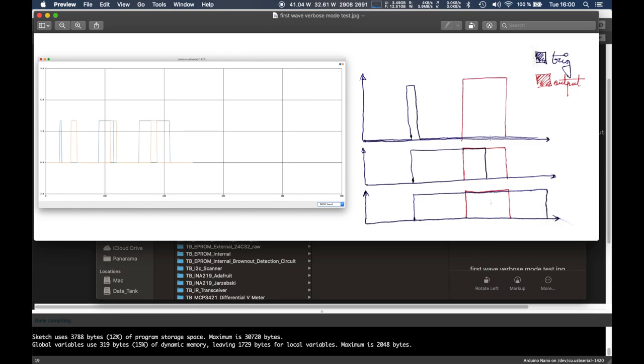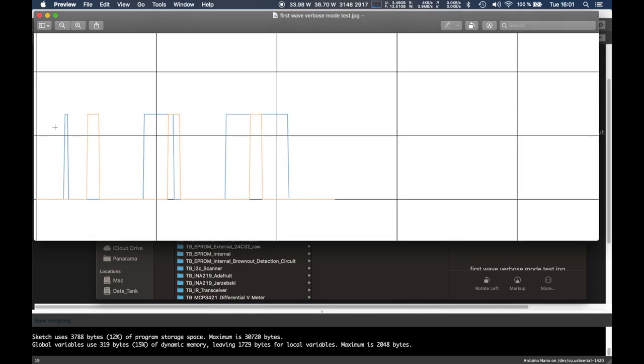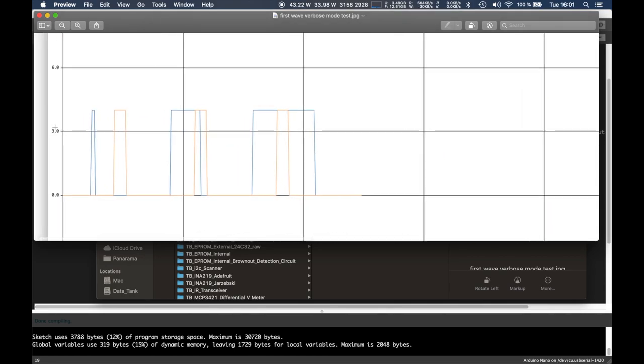As it turns out, the wave generator he has is an actual water wave generator. The controller for that outputs a super long signal. So our trigger is actually longer than our output. And also, for completeness' sake, the trigger could have a falling edge inside the interval under which we are triggering.